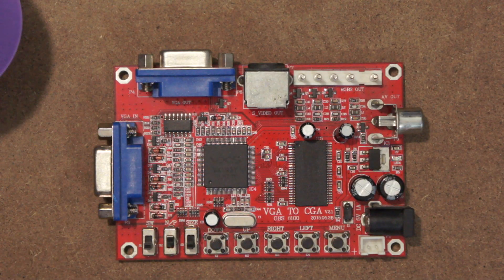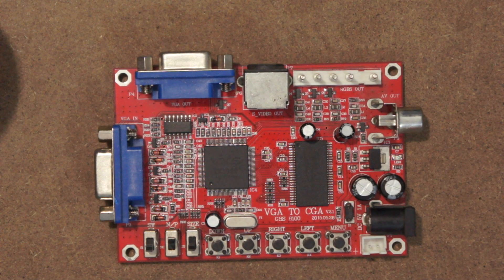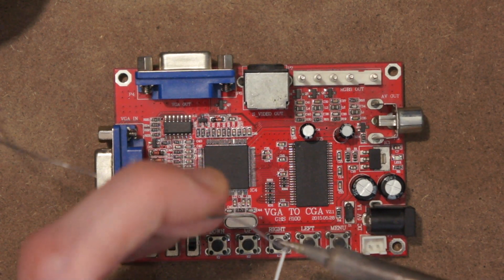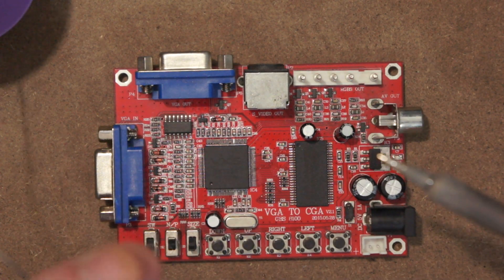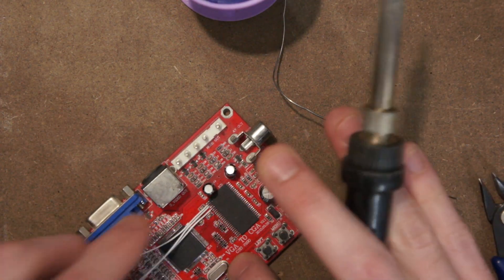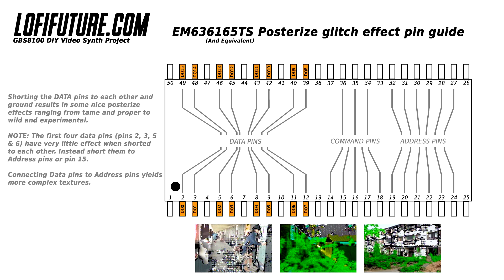Now we're taking a closer look at the GBS-8100 itself. This is the RAM chip that we're going to solder all our wires to. I'll just show the pinout on screen now, showing you all of the safe pins to connect to and all of the pins that you should avoid. To solder to pins this small using this wire, I don't actually trim the end of the wire at all. Instead, I use the soldering iron to heat up the tip just to get the insulation to shrink back a tiny bit, and tin that wire, so we get essentially a millimetre or less of exposed copper that we can solder to these little IC pins. I'm going to be soldering to every single pin except for the power and grounds, simply so I can search for the best pin combinations that result in the best effects. I'll provide documentation to these effect combinations on screen and on my website.